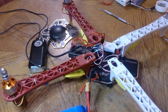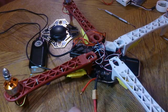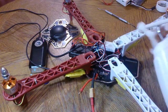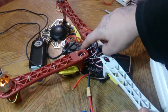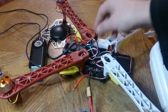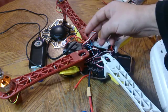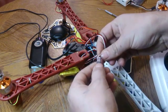So the first thing I'm going to show you guys is how to calibrate the motors with a CX-20 remote. If you're using a power module and you're not powering it through the ESC, remove the power module. I'm currently powering it through motor 1, so what I'm going to want to do is pull this out and remove just the red wire.